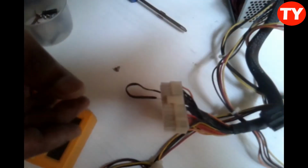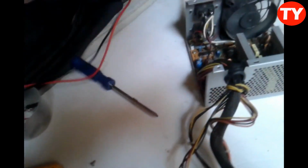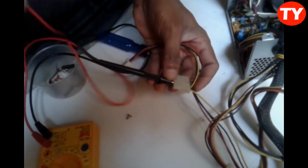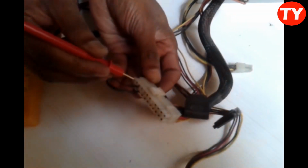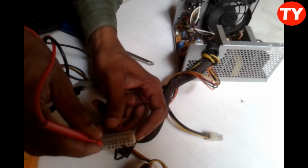Verify. So the motor is a little different. I turned to the DC voltage range 20 volt. Then I am checking, middle pin ground, and yellow pin is plus 12. Yes, we are getting 12, and red pin 5. Okay, everything is working, in this orange 3.3 volt, and we can check minus voltage also, plus 5. Okay, everything is very nice.